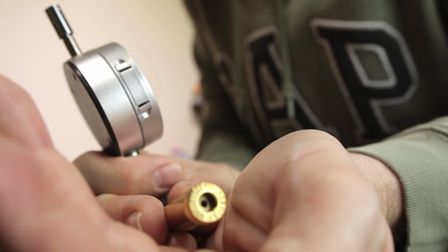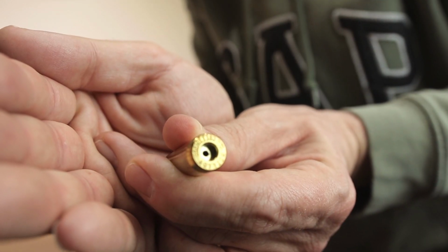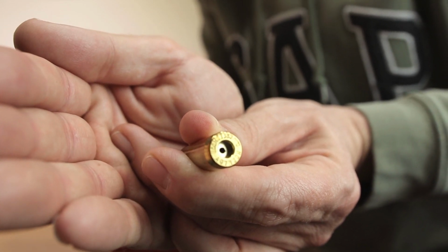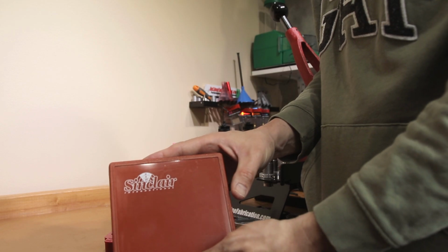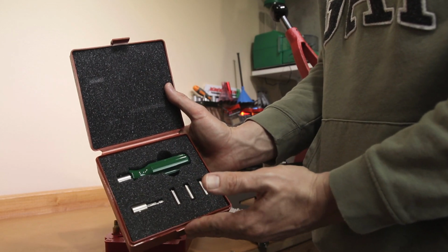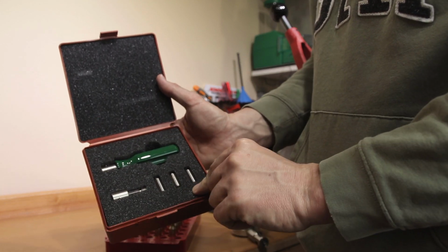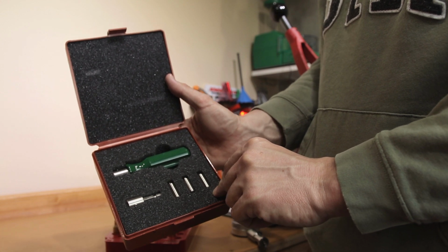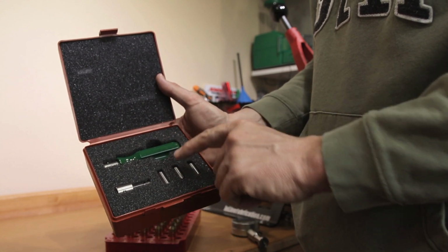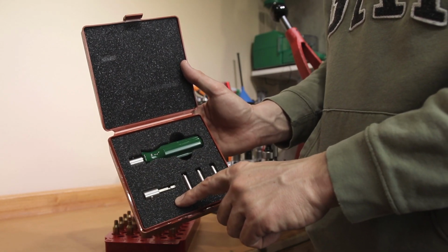And if I could actually put the primer pocket in focus, which I probably won't be able to do, if I could get the camera to focus, maybe you guys can see that the primer pockets on these have been uniformed. Hopefully that makes the primer pocket depth consistent throughout the lot. To perform this operation, we use our Sinclair primer pocket uniformer tool. I think I have a separate video on this that I can link in the description box below if you're interested. But the gist of it, these are fixed depth, so they're not adjustable. But you can uniform the depth of your primer pocket either with a hand tool or with an adapter for your drill. I'm far too lazy for the hand tool, so I pretty much just use the drill.